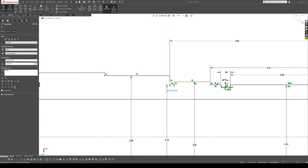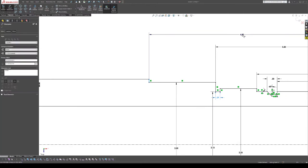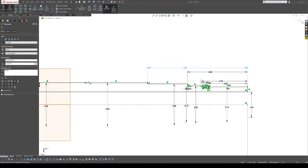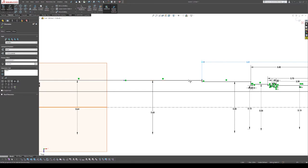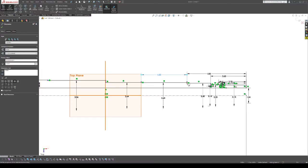For the relief cut, we can measure from here to the next step — that is 0.58125 inches. Then we measure from this next point up and we get a 4.5 inch dimension. I'm not sure how critical that dimension is, but it looks like they cut that a little bit over.